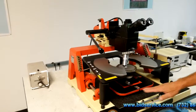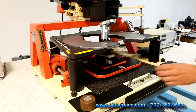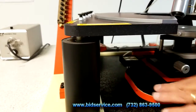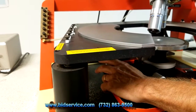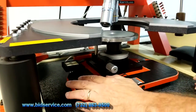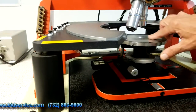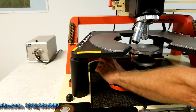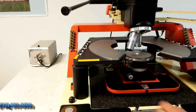Finally, you have a granite block here using an air bearing to move your stage around. There are four buttons down here — the upper left is vacuum, and that's the vacuum for your chuck. I'm going to take the vacuum off by pressing the button. As you can see the wafer is loose on the chuck, and then I'll place the vacuum back on. It's secure.